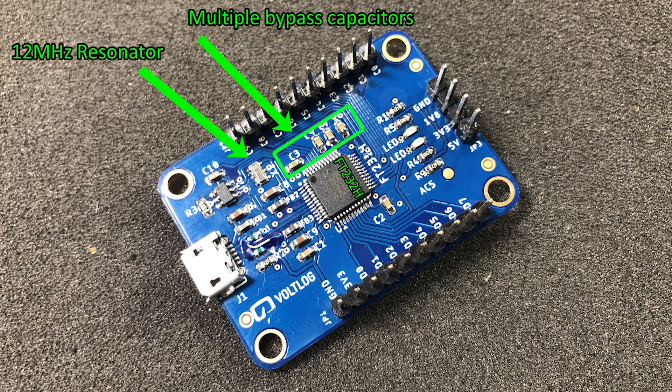There's some filtering on the power lines. The chip has built-in 3.3V and 1.8V LDO, which is capable of 50mA output. We also have ESD protection on the USB input and an external I2C EEPROM that is used for configuring the chip.